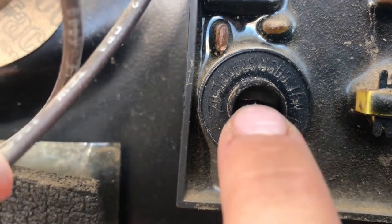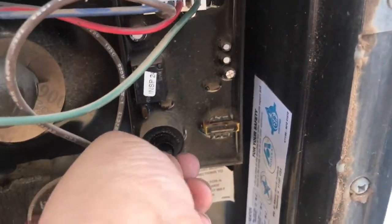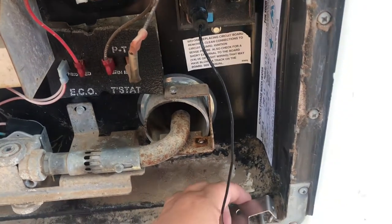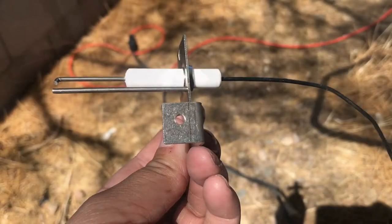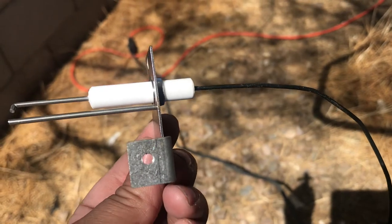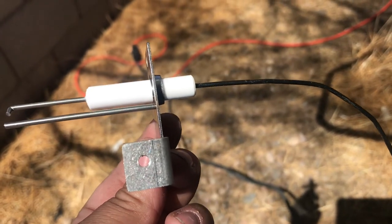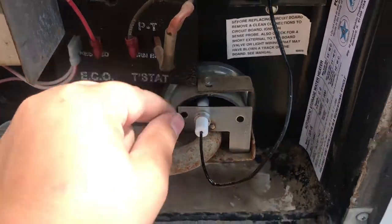This appears to have a little notch up here but not down here, so I'm assuming it goes in this way. Seems I was right — I think it's in all the way. That goes over that, and this is just going to go like that. I was having a heck of a time trying to get this little bolt through the hole, so I took a 9/64th drill bit — just a tiny bit bigger than the hole — and drilled it out with that. Now the bolt will finally go in. It's in there, nice and snug. That's connected.